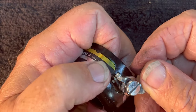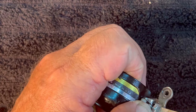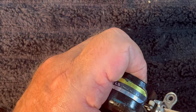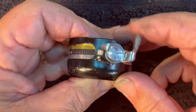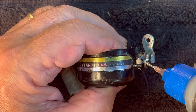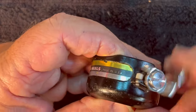You've got a thin arm and a thick arm. This arm over here is the thick arm. So we're going to look on these two screws and find out which one has the short shoulder and which one has the long shoulder. The one with the long shoulder goes on the other side, and the short shoulder goes on this side. Put this in and get it started. Once we get it started, rotate around until the arm gets past the bumper, then screw it in. If you've got it correct and the spring is not trapped, you will have the bail arm seated correctly. Then we add oil to the inside edge, oil to the outside edge, and a little oil in the hole where the tag sits for the spring.